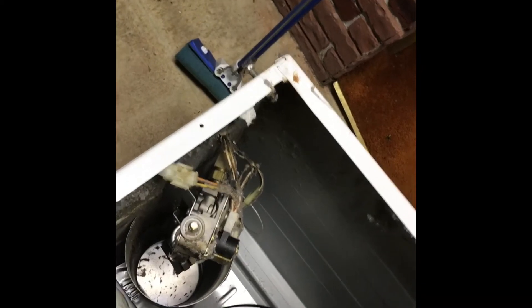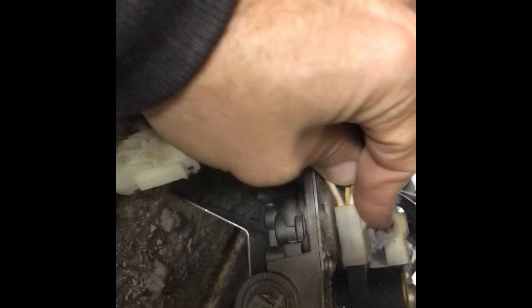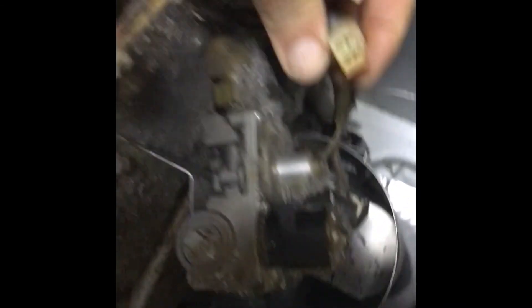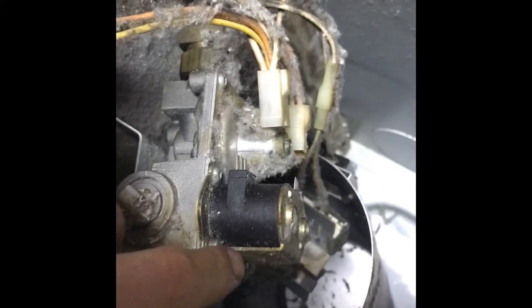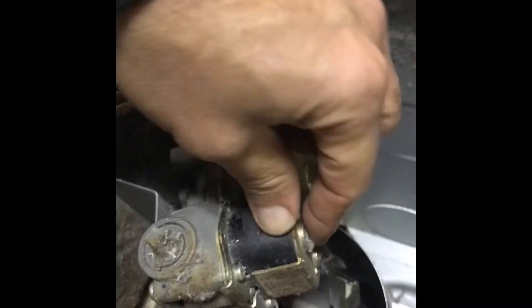I'll possibly put a link in the description. I've used solenoids from an older 20-year unit in a newer unit and they're very compatible. I'm going to take these apart so you can get a better look. The clips come off easy — just a little wiggle. One connector is a three-pin, the other is a two-pin so you can't confuse them. Two Phillips screws hold the bracket that holds the two solenoids in place.